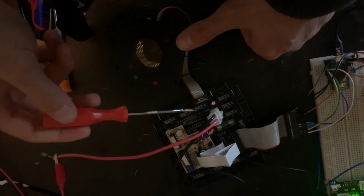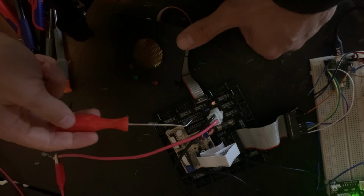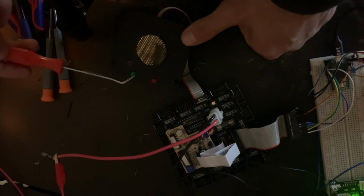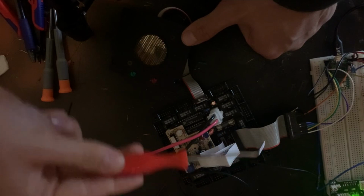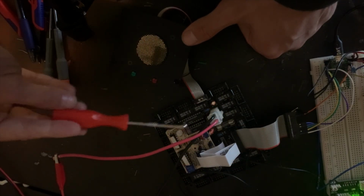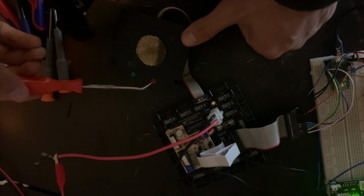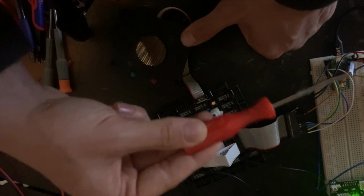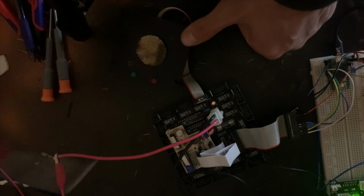move it closer, get smaller, further away. Because the multiplexing chip for the LEDs is receiving the exact same inputs as the multiplexing chip for the relays, and the relays are always on when chosen, you'd think that the LEDs would stay always on, but actually the initialized signal coming from that blue wire runs through an inverter chip kind of underneath this corner of that daughter board, and then to the enable pin on the multiplexer with the LEDs. So the effect of that is that they're only on when that initialized signal occurs, and then it turns back off again when the echo comes back. So that means the light is on for the duration that the sound pulse is traveling to and from.